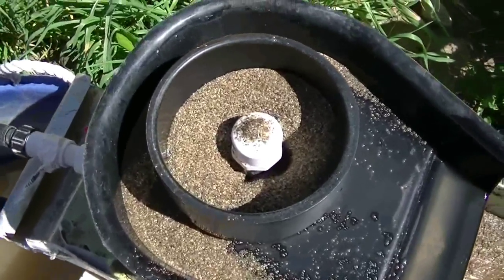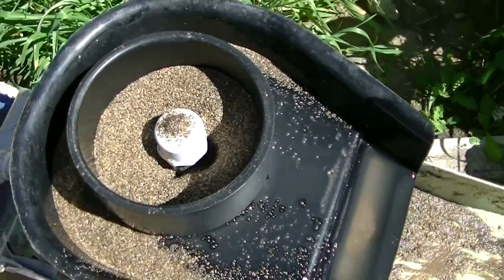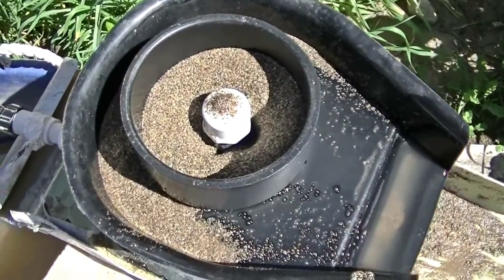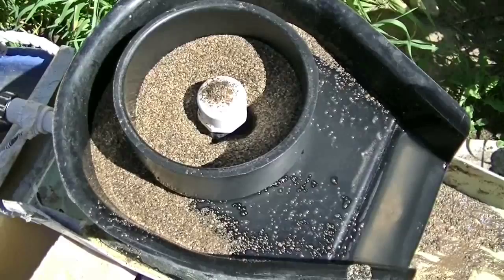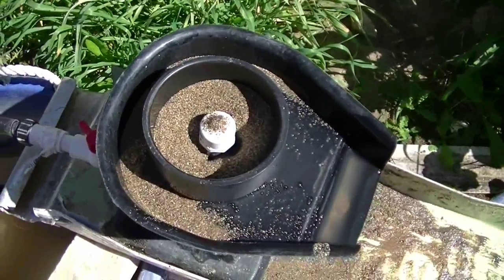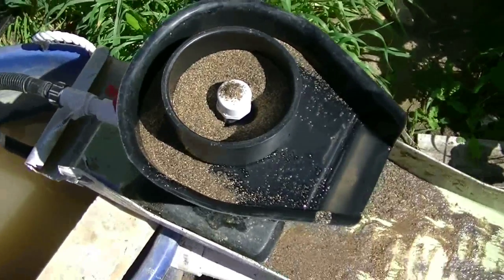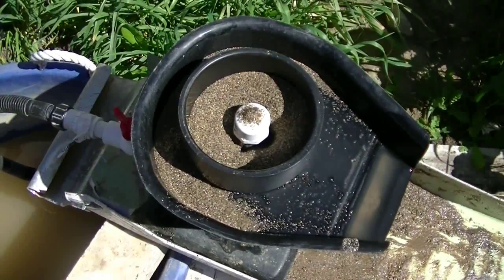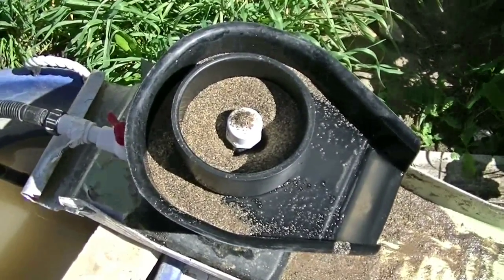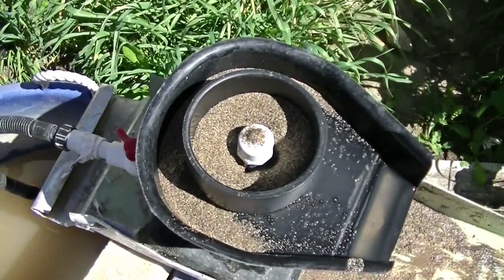You can see the material that's still on there. You can run probably four or five buckets through this before you have to clean it out, so it ain't all plugged up with black sand and increasing your recovery rate. But it works pretty fast — you can go through a five-gallon bucket in about five minutes of minus 12 mesh.